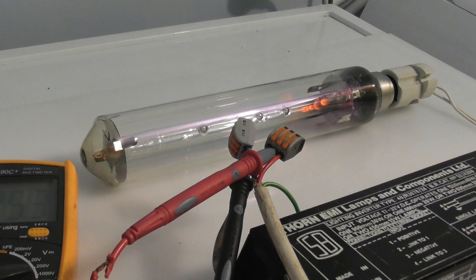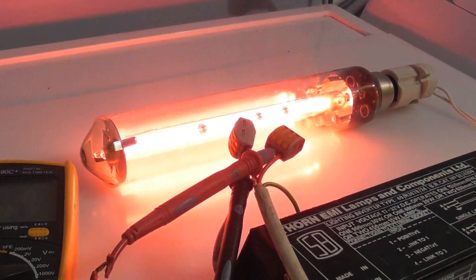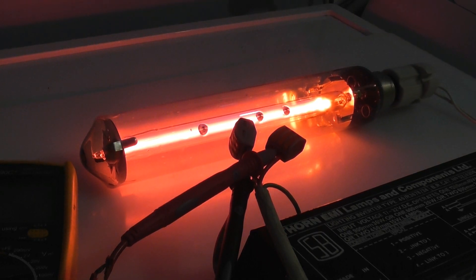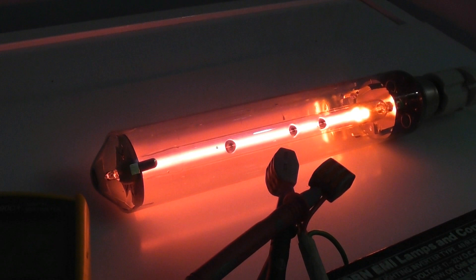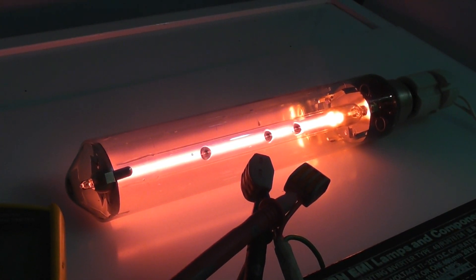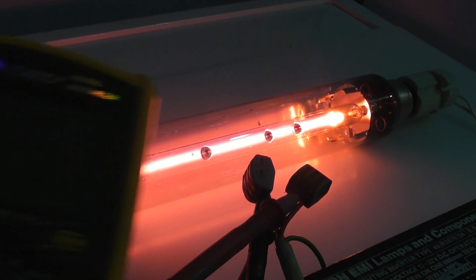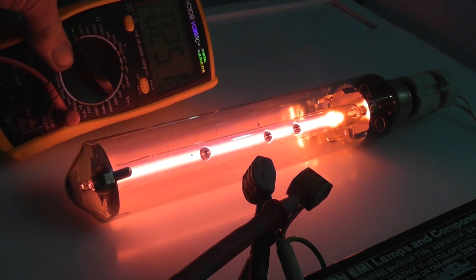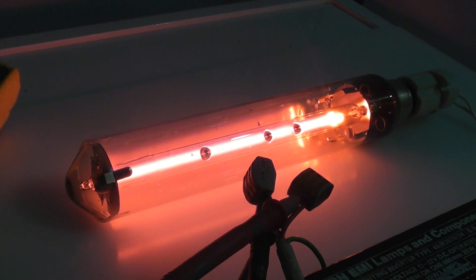And it's fine. It does work — bloody amazing! It's high frequency so it works differently. This is a bridge rectifier device. It's hard to see but voltage is reading 24.1 volts. That's awesome — so it's a railway inverter and it works absolutely stunning.